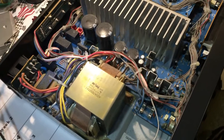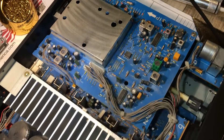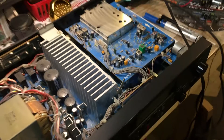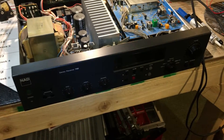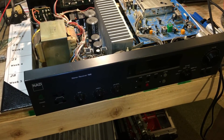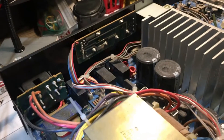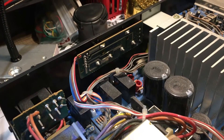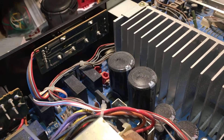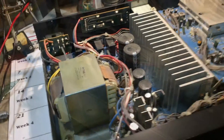This is the inside: I've got the power supply on this end, clearly the power amp in the middle, and the tuner on top. This is one of NAD's first remotely controllable receivers. It had mixed reviews but the audio quality was pretty awesome. One thing to point out — those giant electrolytic capacitors in the power supply have a little bit of a crown. Not going to worry about it for now, but maybe I should in the future.